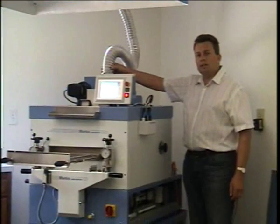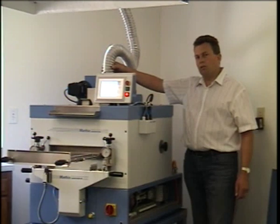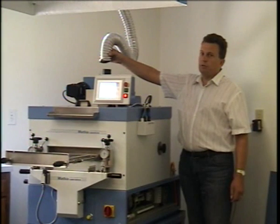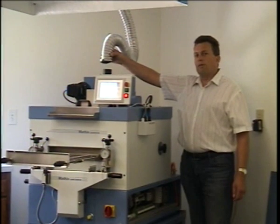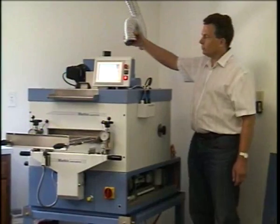However, if you have an exhaust that is assisted by a plant exhaust and draws high velocity, we always recommend having a gap between the exhaust connection and the exhaust port of the fan. This is to prevent vacuum inside the dryer.